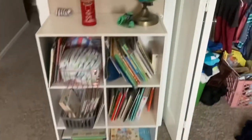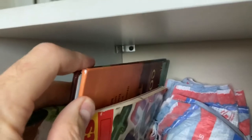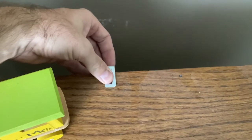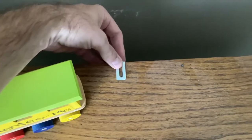I'll put supplies and everything down in the description below. You could use some brackets like these — small plastic or metal L-brackets. I have a bookstand over here that I've secured that way. You just want to make sure it's out of sight, tucked away or at least matching in color. For this piece I'm not going to use an L-bracket because there's not a great place to secure it. If I had a taller piece of furniture I could use an L-bracket, drill it right into the top where it's above the line of sight and hidden. But this is a shorter dresser. You'd drill it into the wall first, then push the furniture against it and drill in through the top.